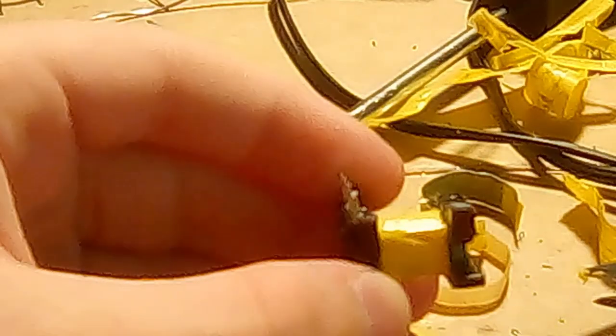Okay, it's definitely tough. Let's see what else is lurking under these tapes. Oh, this is annoying. Okay, so it's done. Looks like we have yet another interference shield, which I guess makes sense since the secondary is in a small sandwich underneath all the rest of the windings. My goodness, this is really not well. Didn't do exactly an amazing job of tearing apart this transformer. Now we have another layer of tape that looks almost like it's molten, but it's just the remains of the tape that was on before it. Now this last layer of tape, and then the primary should be right under this one.